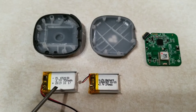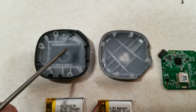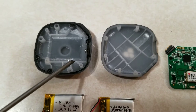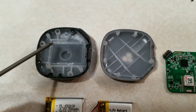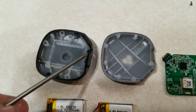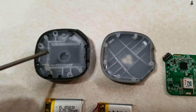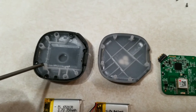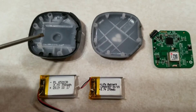This battery is a bit bigger, so in order to accommodate it inside my module, I have started to remove some of the little webbing material in here. You can see where I snipped out a web right here. There are a couple of little tabs reaching to the inside — I shortened those. Now I need to come in here and clean this up, sand it smoother, just to smooth it out so that it doesn't poke any holes through the Mylar film on the battery.